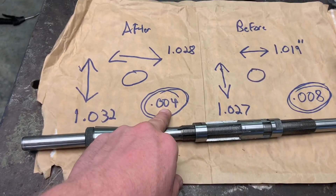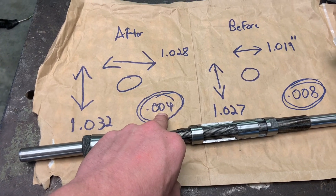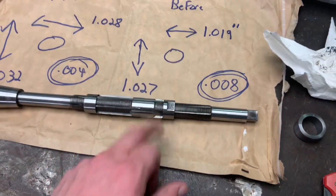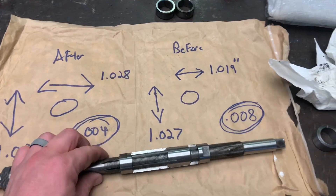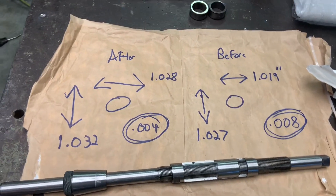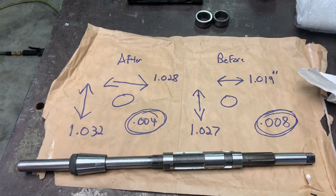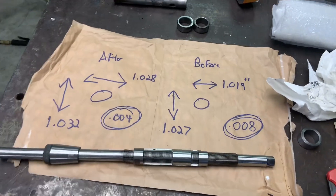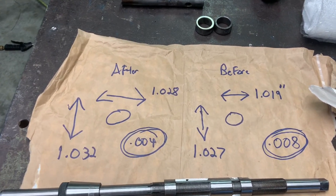To finish it out I'll use a wheel cylinder hone or some sort of brake hone for cars to polish it out and get some of that rough texture out. I don't know — you guys let me know what I'm doing wrong. Is it because I'm using one handle? I'm not going to spend money on professional line boring for this machine. If it ever sees more than 500 hours in my lifetime I'd probably be surprised, but you never know.